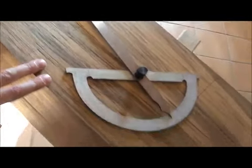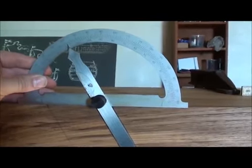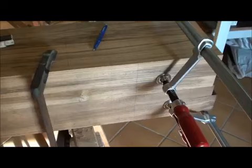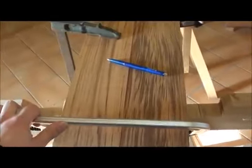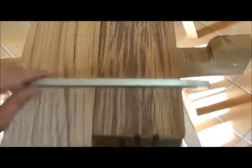And the leg and the bottom horizontal support. I am using one of these to get the angle right on both lines, so I am going to make those lines all the way around the timber. When you do all these markings, make sure that you clamp it well together so the four pieces don't move. If they start to move, your lines are not going to line up anymore. So it is important that when you do the markings, clamp them solid together so they don't move.